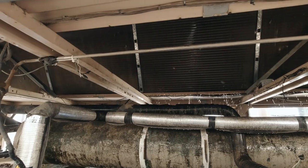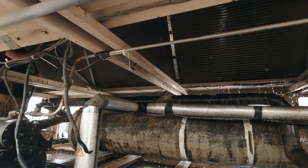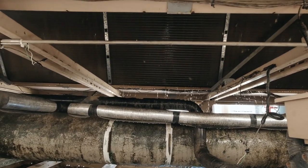Part of what's hurting us is the customer had all of the fans running on each air handler, which is fine — he had no reason not to at the time. What I'm currently doing is turning all the fans off so we can focus on just processing the loop. We're misting the coils just to help give that head pressure a little assistance, and that's actually keeping us under control. This isn't something you'd normally want to do — we're in the process of cleaning the coils. We've already given them one cleaning, but we're going to do another rinse.